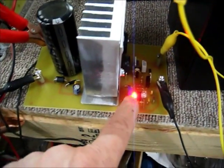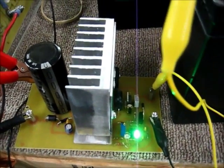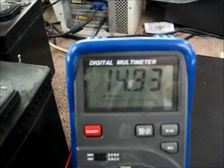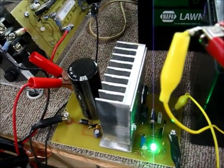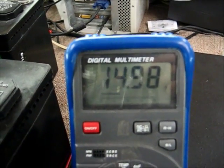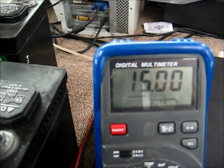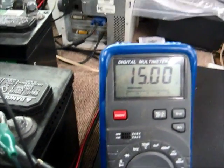There's two indicators. One is going to tell you when the battery's up to 15 volts. This green light — there we go. So we can see that the battery now is approaching 15. And what'll happen when it reaches 15 is the linear regulator will keep it right there. The current will go downhill into the machine because it's just going to top the battery, so it's not going to waste any energy. It's already charged. We're at 15 volts on the battery, and it should stay right there. We'll come back in a few minutes and see where it is.